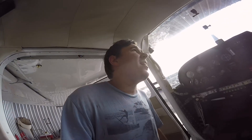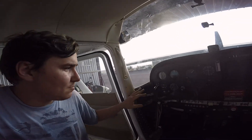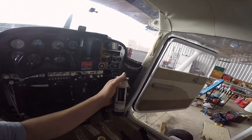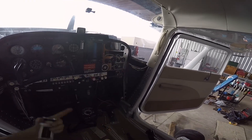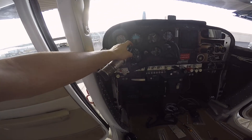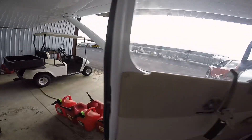I'm just going to show you where I left off. I've got the plastic panels back in and I've got all those harnesses zip-tied. That reminds me, I need to put this back in here — which is kind of funny because this thing is now going to have three outside air temperature probes if you include the one on the JPI. I went ahead and changed the push-to-talk switch too. That's pretty easy: you just pull it out, solder the new leads on, and you are done.